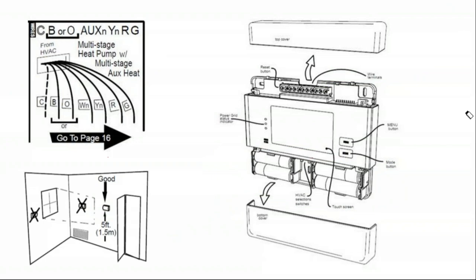The only advice I have on thermostats is if you're swapping out your thermostat, make sure you're powering down the whole air conditioning system, because you can blow fuses inside the air handler by just taking a powered thermostat off the wall and swapping it out with a new one. You might think, oh, this is just low voltage coming out to the thermostat. I don't need to worry about powering down the big units, the double pole breakers, but those low voltage wires are connected to those big units, and they do have fuses that can short if you are touching these small wires together.